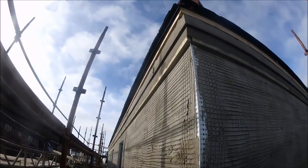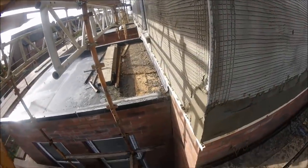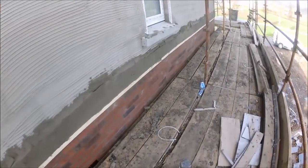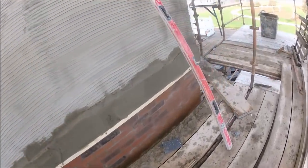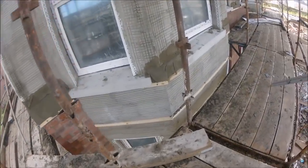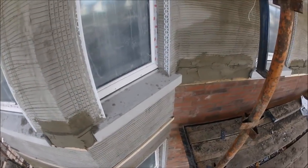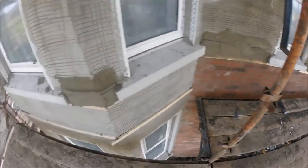You can sort of see what's happening here with the depth you need to get this on with. As I said in the previous video, if you're doing a big amount of bands you might want to mix up a nice batch of sand cement. If we were only doing one side of this house we'd mix the batch stiffer so we could get it on, get it rubbed, and get it cut. But we're putting on quite a lot, so we've mixed it a bit softer so we'll have time to continue working around all of these. You can see it's taking shape — that's the continuation between the sills I was talking about.